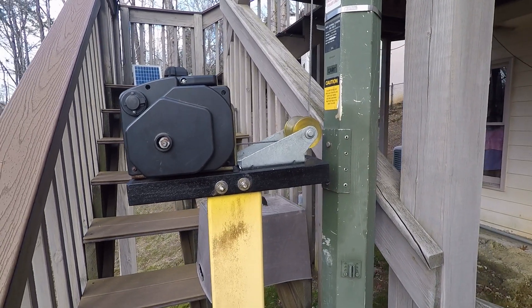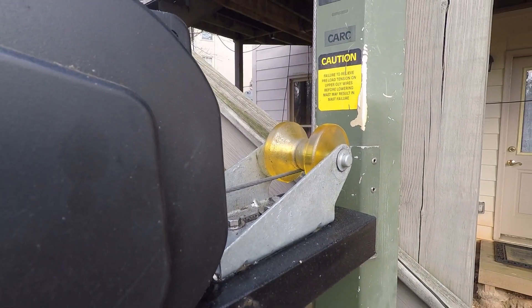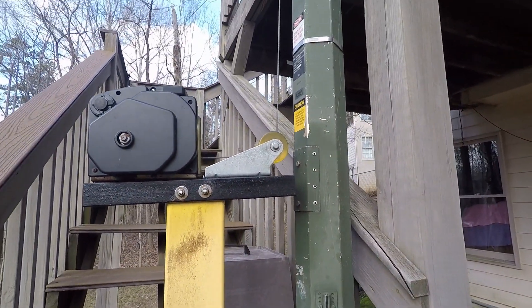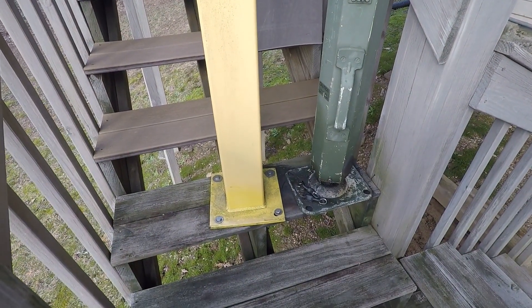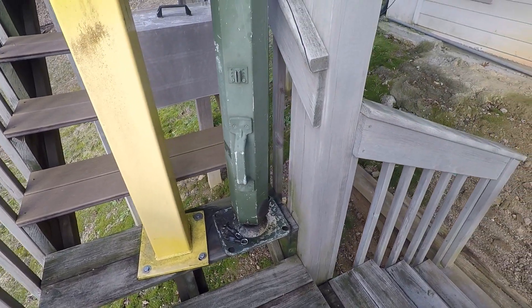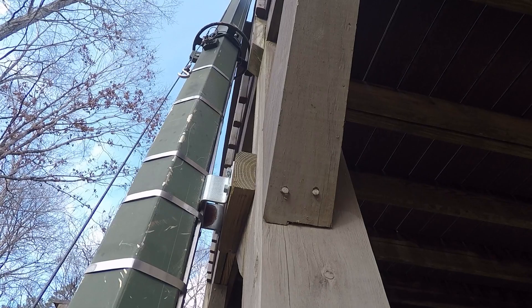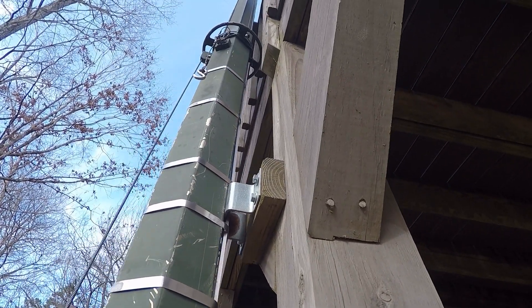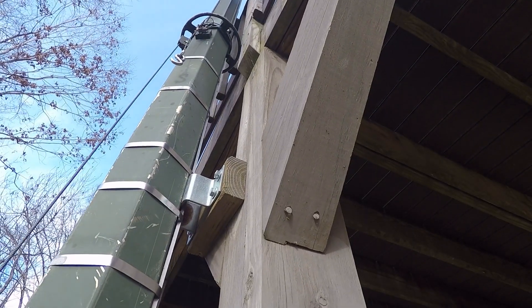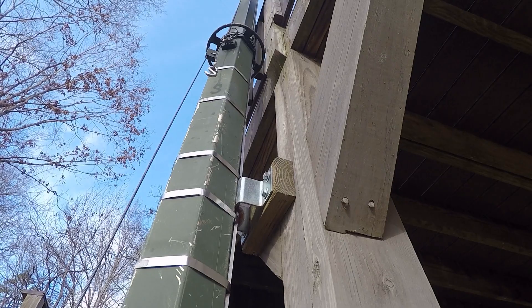Metal channel formed the base plate here, a bracket and a boat keel roller — I'll show you more from a different angle where the cable goes under the roller and up to the mast. I found this bollard on eBay; it cost more to ship it to me than the bollard itself cost. I fabricated my own mounting bracket out of a U-shaped metal channel, some stainless steel lag screws, and a piece of flat stainless steel bar held in place on the back side of the mast by six stainless steel hose clamps.